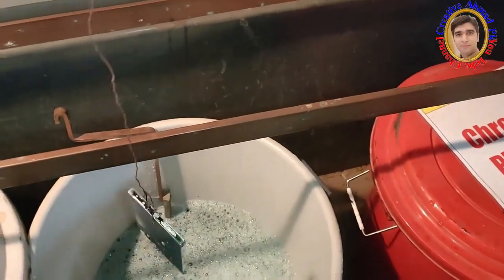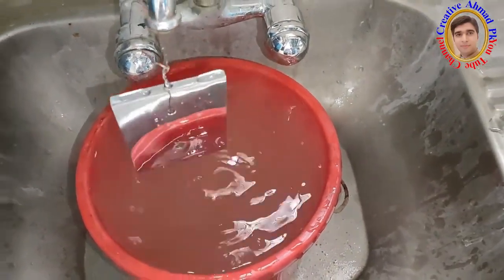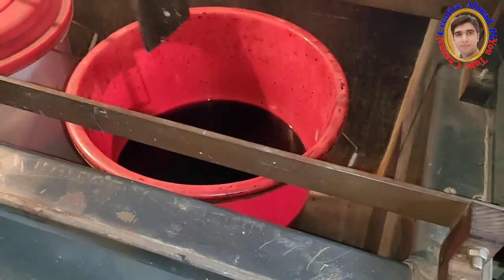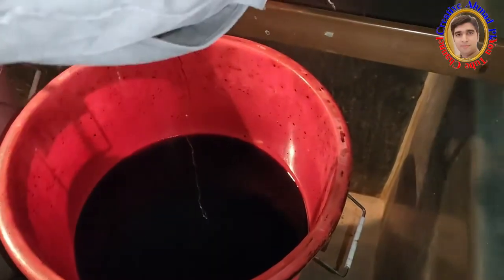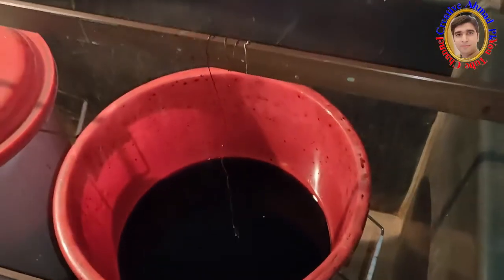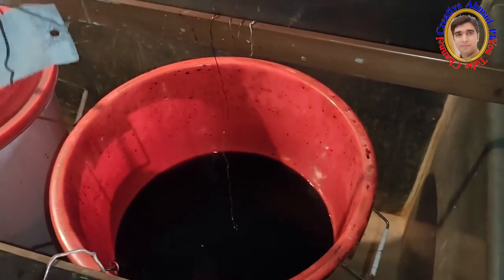After this process, the workpiece has to be washed well with water. After this, the process of chrome plating on the workpiece begins. Chrome plating connects the workpiece to a cathode connection in the chrome solution, and the lead material is connected to the anode connection.